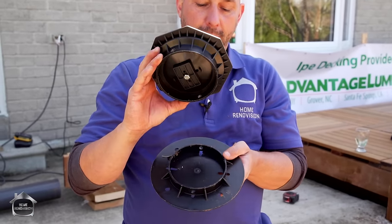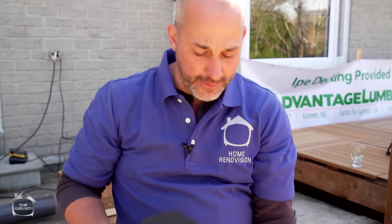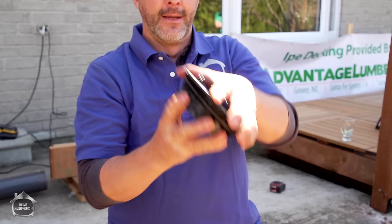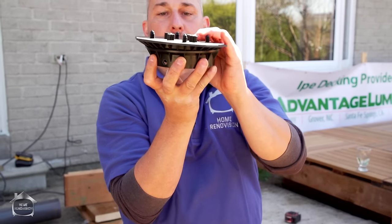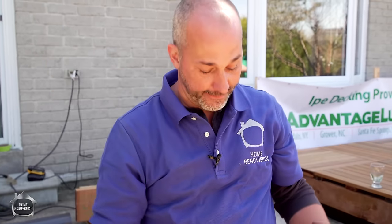Now this comes with some little core that you can actually buy and install, and you can raise these pedestals to any height you need to help level off your deck. And they have an adjustment on it so that you can change the angle to follow the slope of your structure. This is awesome because ours has a 5-inch change from the middle to the outside corner. We're gonna be needing it. We're gonna lift up the whole deck to get rid of the need for a step going into the house. And it's not gonna go down quite as quick, but it will last just as long.